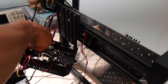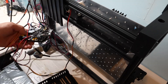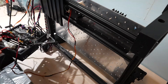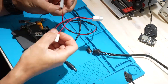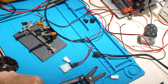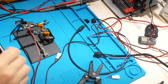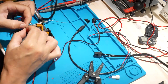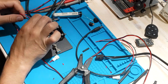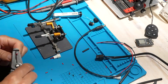About the lights — I've got a full video on that, watch it if you want the deep dive. Quick version: for the old RGB ring I briefly borrowed 5V from my PC with an extra modular Molex lead — Molex gives 5V and 12V, I only used 5V so I could plug and unplug while testing. For this build we don't need that anymore; the new 24V ring runs straight from the SKR mini fan header with PWM, so no extra USB and no PC power tap.